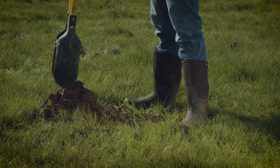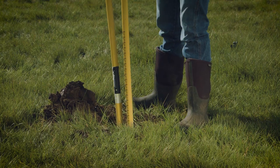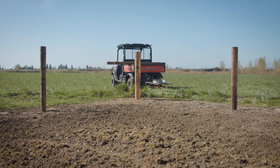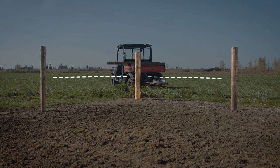To get started, we've already dug three holes, each one 30 inches deep. The installers are making sure the corner post is plumb using a strap-on post plumb. The next two holes should be less than eight feet away from the corner along the fence line, and both should be set at the same depth.